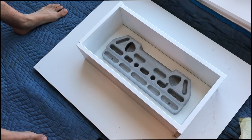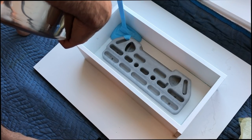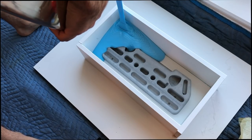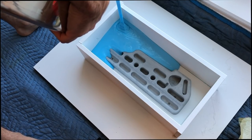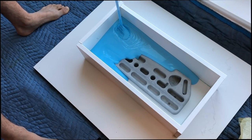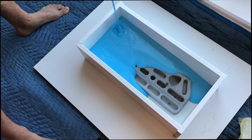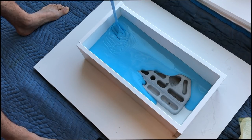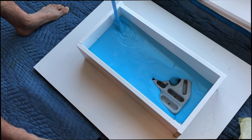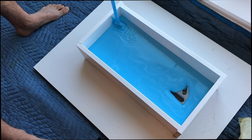Now the interesting part — we pour the silicone over our enclosed part. I simply glued a box around my part and you can do this however you'd like. Two points for better practice: first, always pour the silicone at the corner, not directly on the piece. This will allow it to slowly climb over the piece and displace any air in any cavity, otherwise you may trap huge bubbles inside. Second, lift the bucket very high in order to make the stream very thin — this allows leftover air bubbles to pop before hitting the molds.